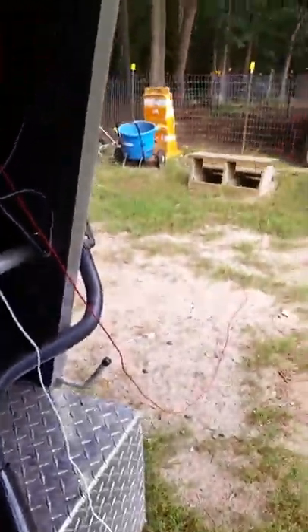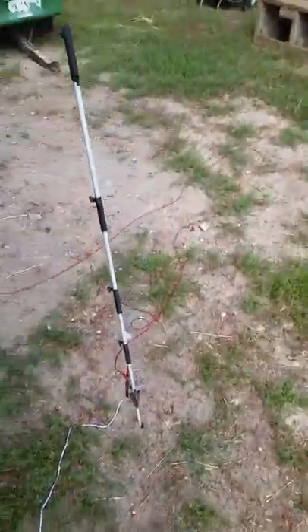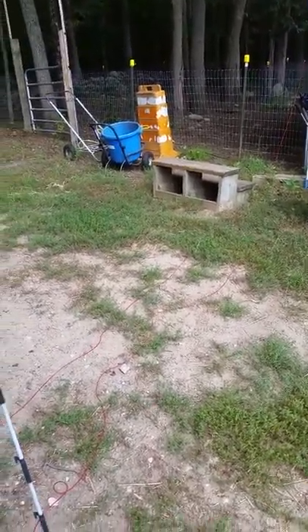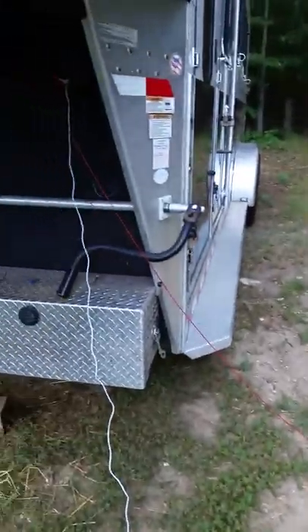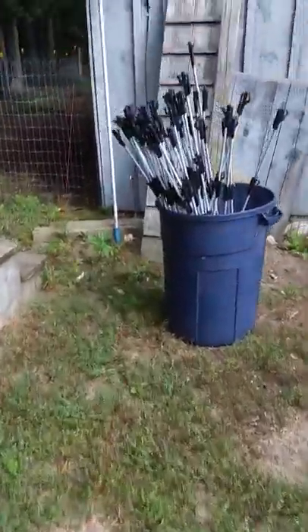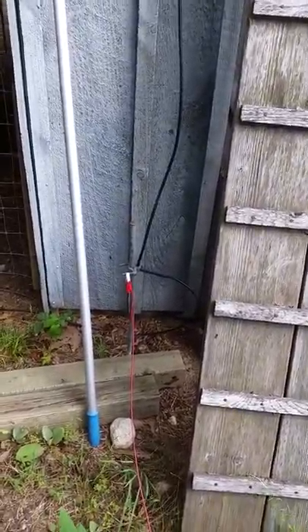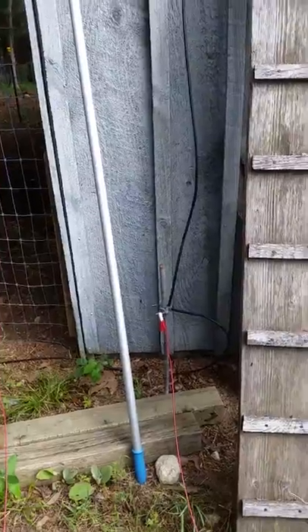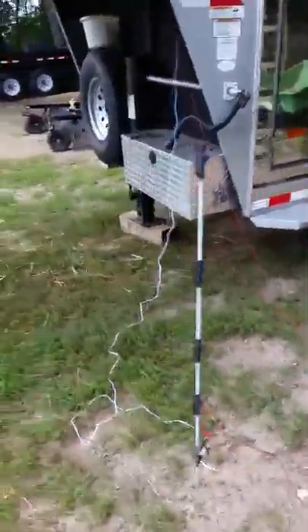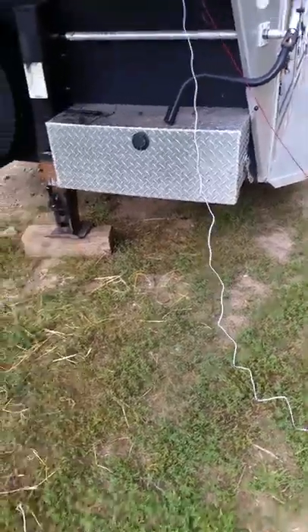Now for the ground rod — initially I tried just using a tent stake like some people have talked about, but the problem was the ground wasn't strong enough and it actually reverses the polarity, so all of your charge is going into the ground instead of into the fence. For now I ran two of my temporary wires and connected it into the ground rod I have next to the barn, which is an eight foot rod driven about seven feet into the ground with a second one about eight feet away. For traveling, I'm going to pick up a piece of rebar that I can easily hammer into the ground and then set a cone over it up underneath the front edge of the trailer.